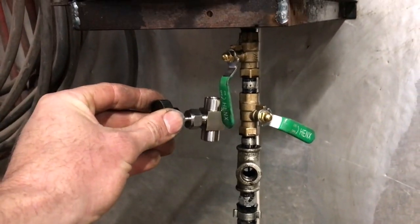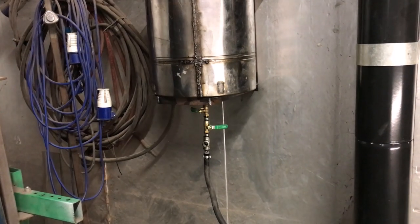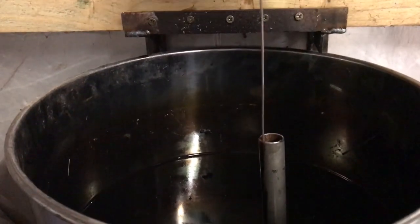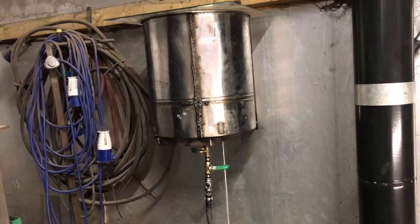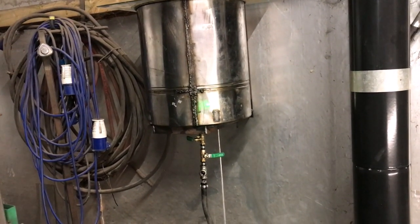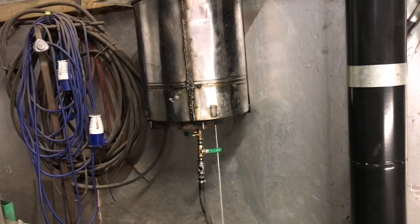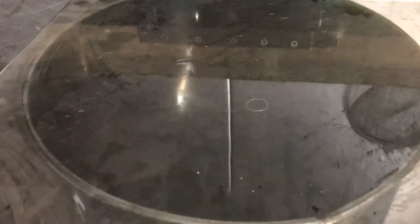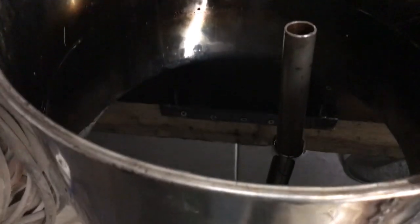There is a tube within the tank that goes right to the top. This allows you to poke something down the tube should there be a stubborn blockage. The tube has several cross holes a couple inches above the bottom of the tank to allow sediment to fall to the bottom and prevent it going into the feed tube. The tank is just an old water heater that can take 25 litres. I had a bit of a nightmare stopping the leaks for which it was thrown out. It's thin overlap stainless and didn't like being welded.